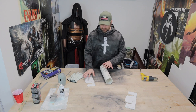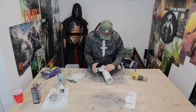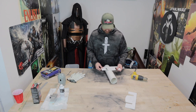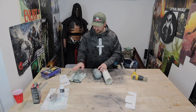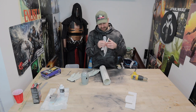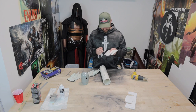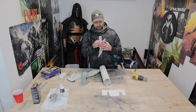You can melt Sintra with a heat gun, so be careful. You want to heat it evenly and then give it a nice tweak around one way, let it cool, heat up the next section, and tweak it the other way. Maybe try to get a slight roll in the front edge so it's not looking like a straight thing. I was smart enough to glue the template on the actual plastic side, so I should be able to peel it off. I just need to make sure that since these are lefts and rights, I bend one one way and the other the other.